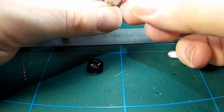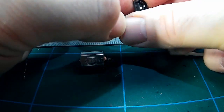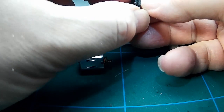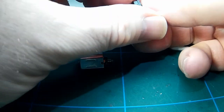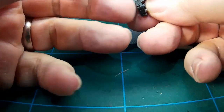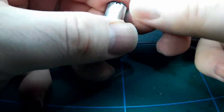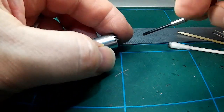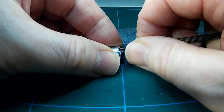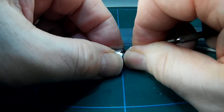So now we put the armature back inside the motor housing, keeping it proud, still sticking out. Note that the little lug on the cap goes into the corresponding slot on the motor body. This is the way it polarizes it. Fingers and thumbs there, right, it's all back together. So now we must bend those clips down. Now I've done it twice, they're starting to get soft already, so there isn't much life in those. As I say, it's not designed for servicing at all really.